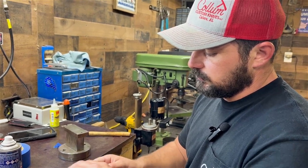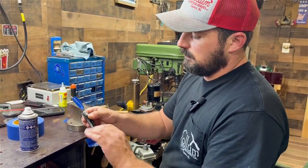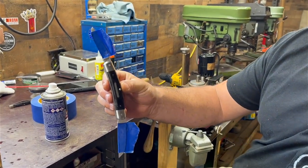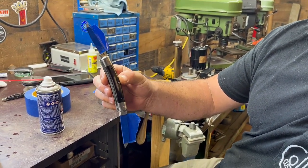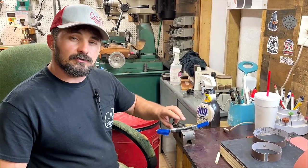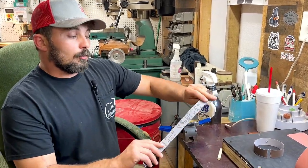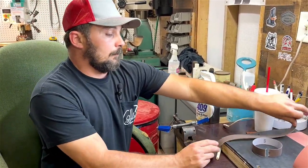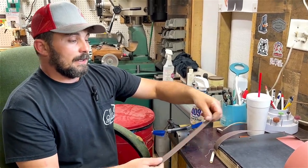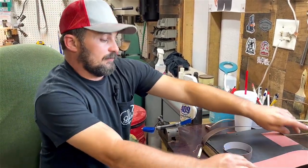There is a fully functioning Waterville cap muskrat. Our next step is taking the pins off and getting the knife cleaned up and finally shaped. We're ready to clean up the handle. I've clamped the knife in the vise and stuffed cloth inside the trough of the knife to help keep sanding debris out. I'll start with 220 cloth-back, then go to 600 cloth-back, then finish with 600 paper-back for straight pulls.